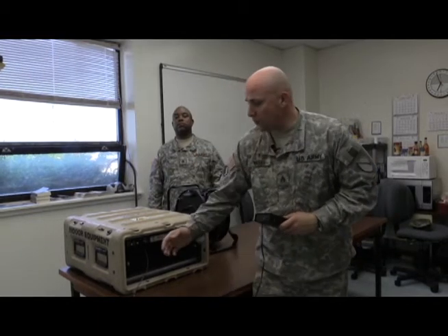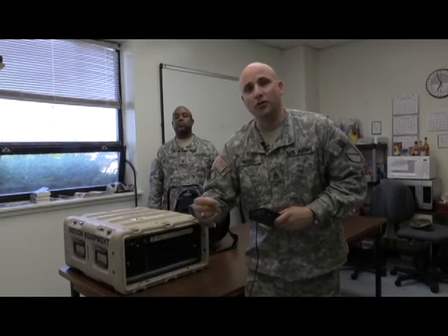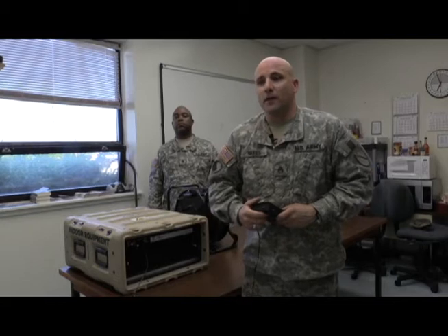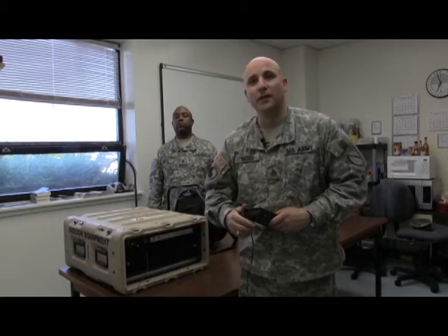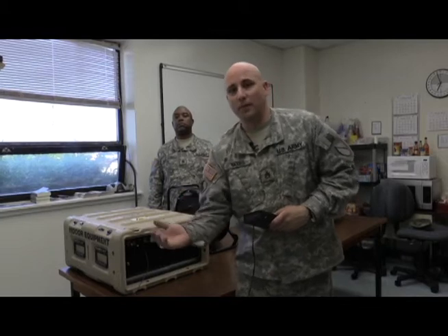Keep in mind when you're doing that, you always want to hit the RF switch when you go in front of the satellite dish and turn that off to ensure that you're not getting any signals from the RF. Once everything's done and you're packing everything up, make sure the last thing you do is turn the antenna switch off. That way everything's in the off position, and then you're ready to put your four boxes up and head back home.